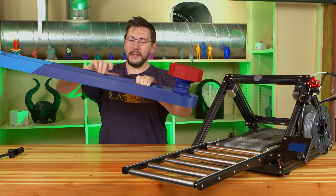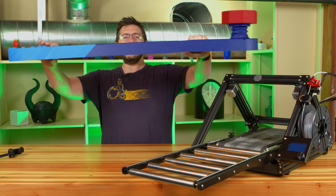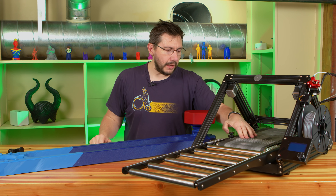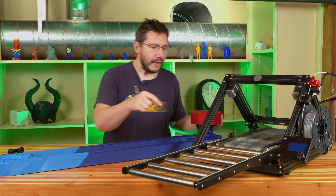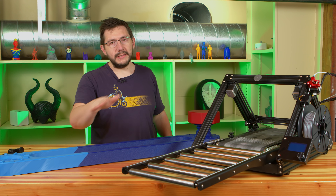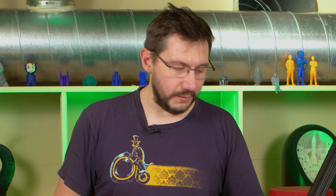This is Atomic Filament here, and this is Filament One Glint PLA. We talked about an issue — you can see a little dip right there. That dip is because my pre-production CR30 still has a little bit of an issue. There is a downhill from the cooling plate down to the roller right here. I've spoken with Naomi Wu, and there are new pieces to put on either side of the end roller that raise it up and make the bed completely flat across the top without that downhill, which will then make it easier for parts to eject and disassociate themselves with the bed.